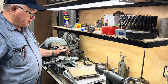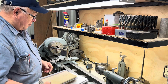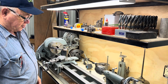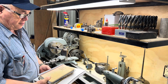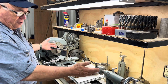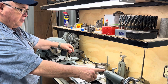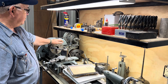Good morning and welcome back to the shop. If you saw my other video, this is my lathe — I made the pieces for my stomp shear off of this: the springs, the collars, the spacers, and so forth. This is a good all-around lathe; it's a TH-54 Atlas. You've got about 30 to 32 inches of space between the chucks. This one comes out and gives you a dead center.